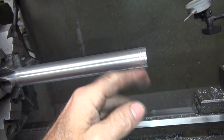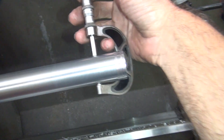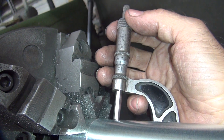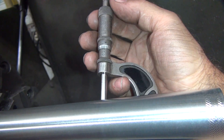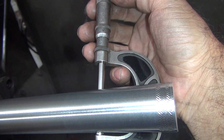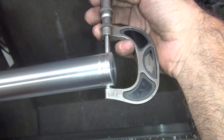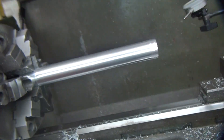That's probably because it's pushing away from the bit — we're way out here and the chuck's not really working good right now. Yeah, we're losing dimension, losing distance, or cutting. We're just over 12 down here, about 12.25. 12.1, 12.1 — slid to the stop right there — 12.5, 13, 12.8. And 13 right at the chatter. Across the chatter it's going to be screwed — 15 — because it actually makes the metal taller, it's like knurling. So that's pretty damn close on that.